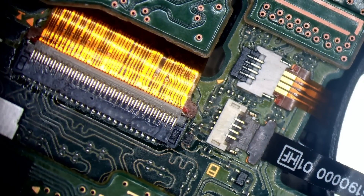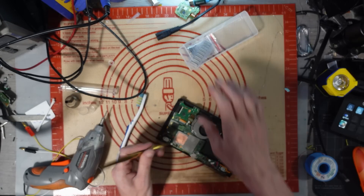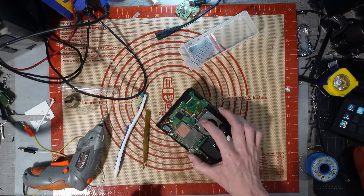There you go — it's the fan! That fan is spinning but it's not on high speed. The sense wire is not there on this fan — it looks like the sense wire is damaged. Because the sense wire is damaged it can't sense the RPM of the fan, so it's just maximising the fan speed, pumping out as much power as it can. With this replacement fan it's nice and silent — that's solved it!